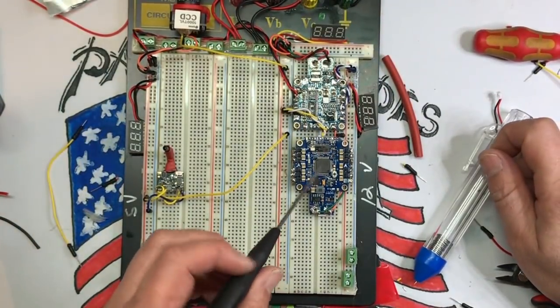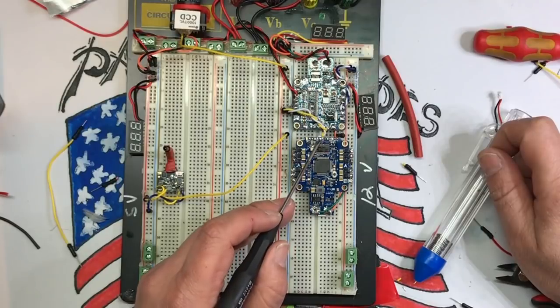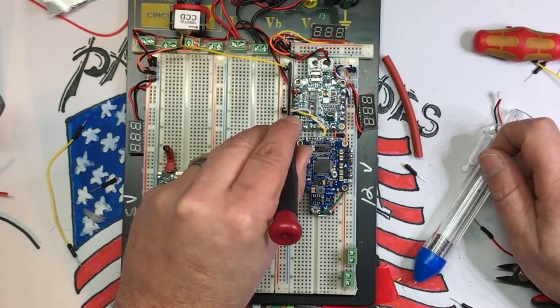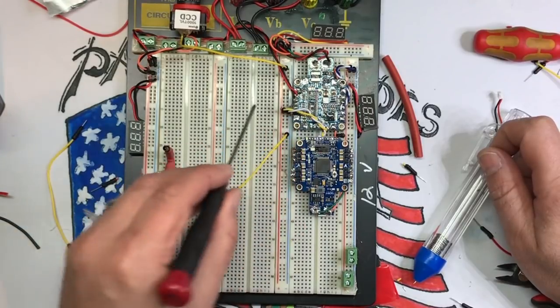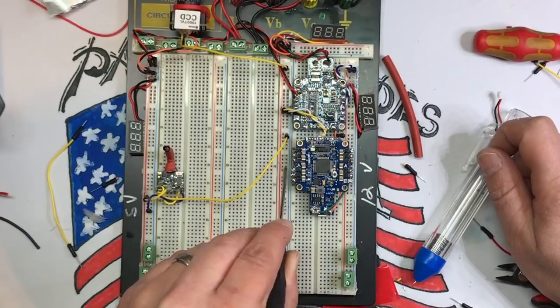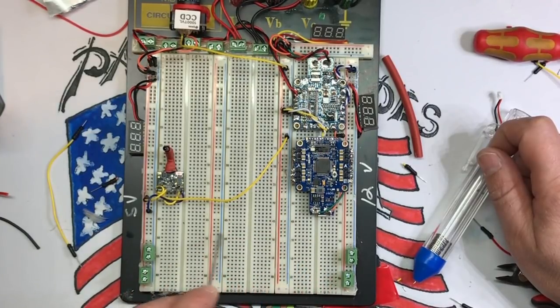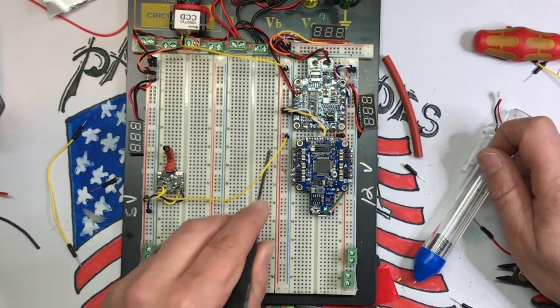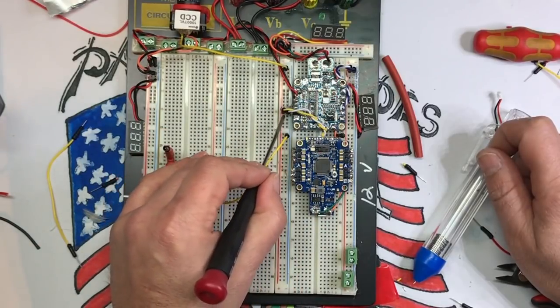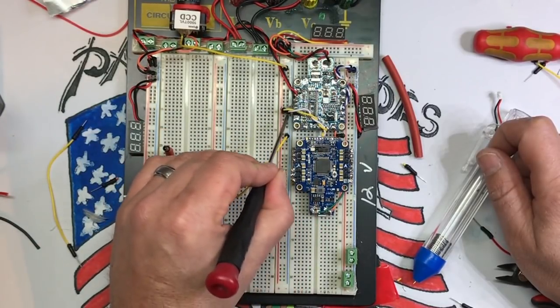Then I wired two into the video in and video out. My video in is yellow. This bar, even though this terminal says positive and negative on it going down the center here, is a dead bar. This is dead. These are all dead. Okay. So basically I ran my video in to this side, my video out to this side.